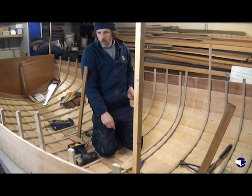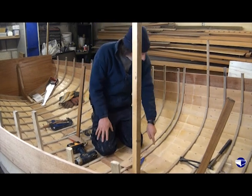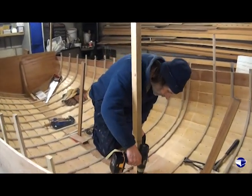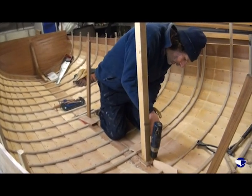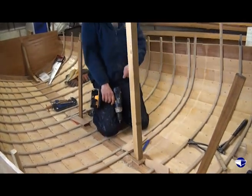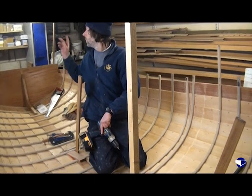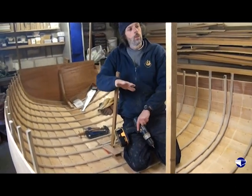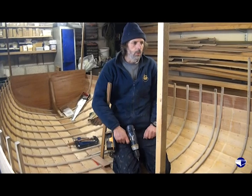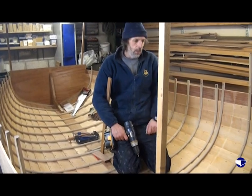We've got a little bit of cleaning up to do because the inside had a coat of clear sealer before we put the ribs in, and obviously where the moulds were we couldn't get to, so they need to be sanded up. I'll take the post out so it's out of the way. The boat's still held up — the keel's still screwed to the strong back underneath, the stem is still braced from the ceiling, the transom's still braced from the ceiling. So the boat should remain upright and level for us to fit out all the seats, the stringers, the centre plate case and all that sort of thing.